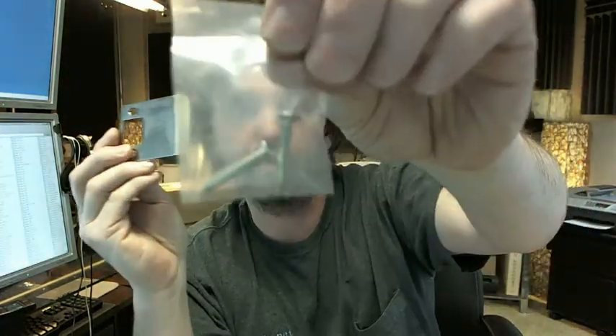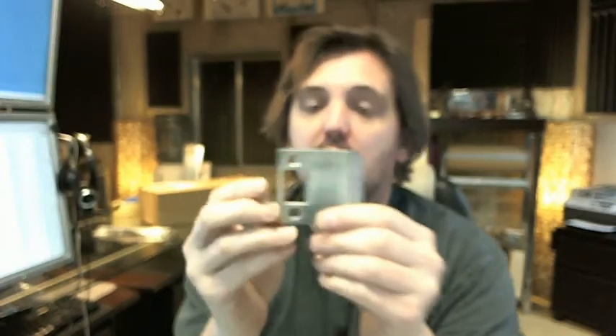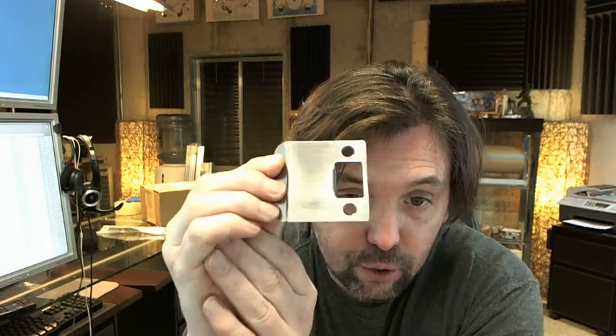That's an extended lip strike — how it's measured from here to here. It's going to include two screws and a complimentary finish. This is a very typical item to use, especially the two inch, if you have a situation where you have thicker than standard casing being installed on a new job or on a remodel.